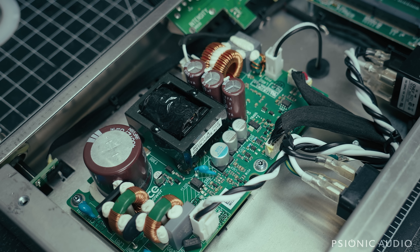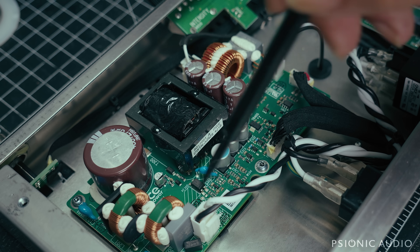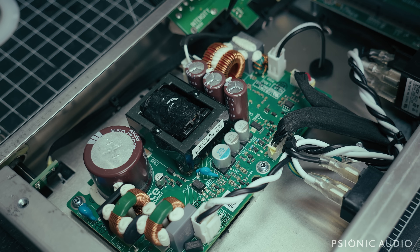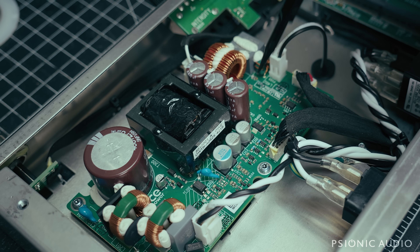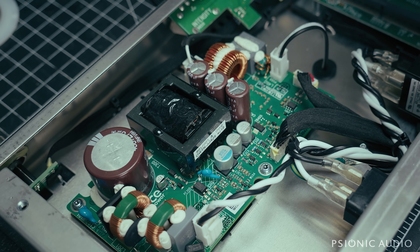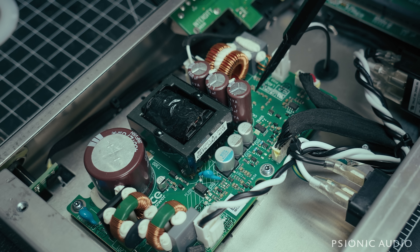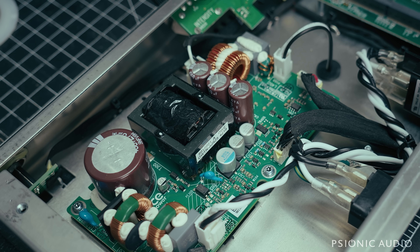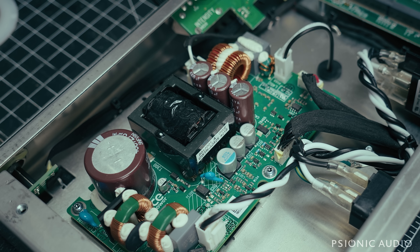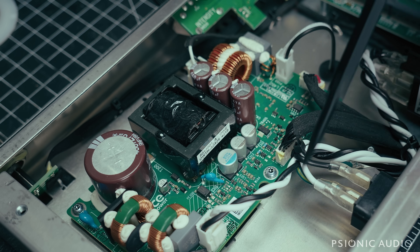To see if that was necessary, I disconnected everything, removed the board, examined it closely top and bottom, did not see or smell anything at all here. So I was unsure whether this would be a problem. It's very difficult without a schematic to know where to take voltage measurements, because I can sometimes grab a reading and say we've got plus 35, negative 35, that's probably fine — but I don't know where in the rest of the amp to measure because I don't have the schematic and it's basically a little computer. But if your troubleshooting involves logical flow, you kind of know where to go next.